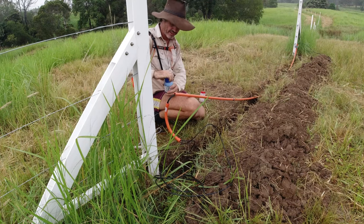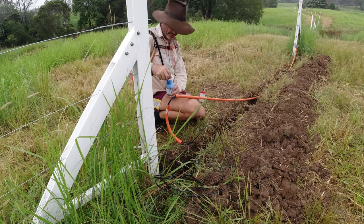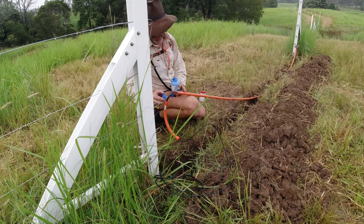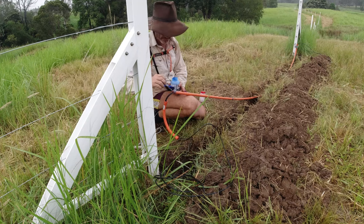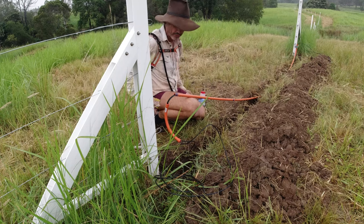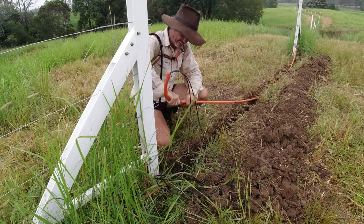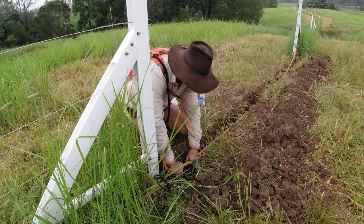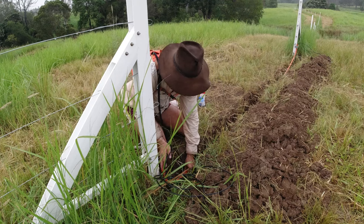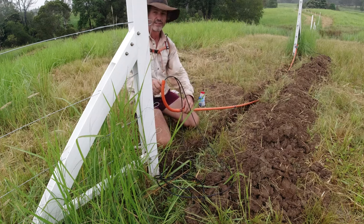Same again on this end. As you can see, the other end is taped to the A-frame brace so it's sitting vertical and straight up. I want to be quick on this end and I'm not going to twist the straight section, because in these wet conditions the 100-mile-an-hour tape is going to come off the wet post. I'm just going to do the elbow — twist it on and make sure it's 90 degrees — then let that sit for five minutes and continue on up.